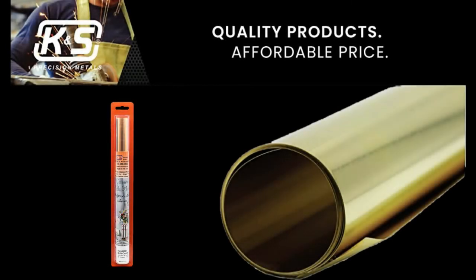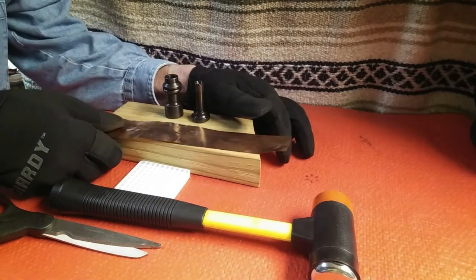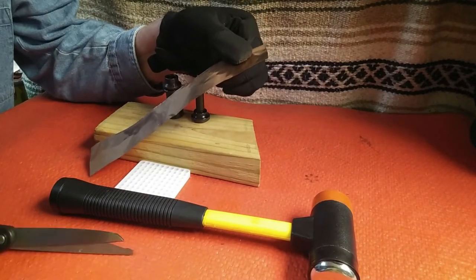My alternative is to use copper sheeting that I obtained through the Jungle website. The copper sheeting is soft copper with a thickness of 0.005 inch or 36 gauge. This sheeting is a roll of copper 12 inches wide by 30 inches in length. I can make percussion cap shells until the cows come home. I included a link to the product in the description. I cut the copper sheeting into 1 1/2 inch strips. The punch will create a hole approximately 3/8 inch in diameter in the sheeting strip while forming the cap into the proper shape as the punch is forced downward.